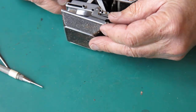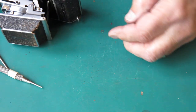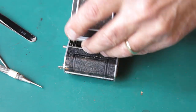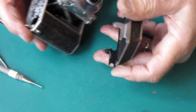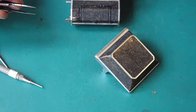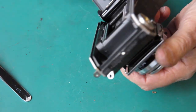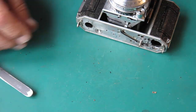Back to the base of the camera — this is the lever that latches the rewind button in place when you click it, and it's released again once you move the film advance lever. Take that spring out. Three screws hold the bush at the base of the film advance shaft. I can lift the film advance shaft out of the camera. There's not much to go wrong with these except they get stressed at the top — there's very little meat left there with that squared end. If it's got a twist in it, that means one end is revolving not quite as far as the piece at the top, so things don't happen that should happen. Now take the door off — there's a hinge pin screw at the base and at the top, and there'll be at least one washer shimming that out to take the rattle out. There's a washer at the bottom of the door. The door lifts off over the top — it's got two paper washers here that provide a little bit of friction.